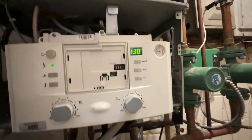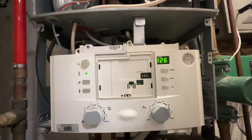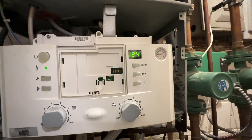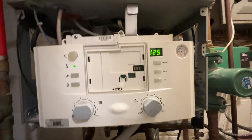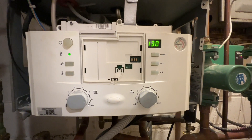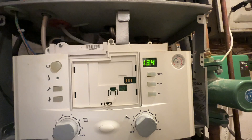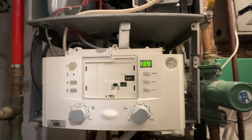Let's see what happens once the water comes off. It takes a really long time to go back into space heating. Got both zones calling. I did the flush on the domestic water side when I was here last. There are no ports to do a flush anywhere else. Yeah, we're back in heating. The flame just went off — why did that flame turn off? It just seems very odd the way this machine's running.